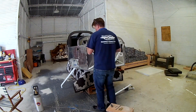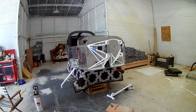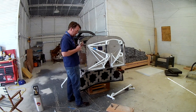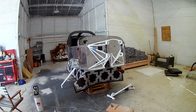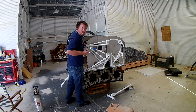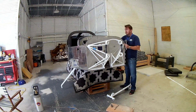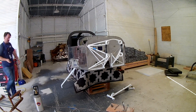What we had to do was first fill in the rivet holes for the regular battery box and then go back and put nut plates in. What we're doing here is permanently mounting the engine mount with the torque wrench to get those things in tight. We're putting in four nut plates — I think size 8 or size 10 — because the battery box comes with four holes drilled in it already, which is good because that's how we'll also mount the second battery box later.